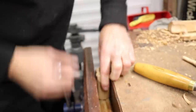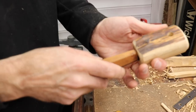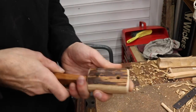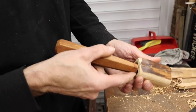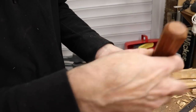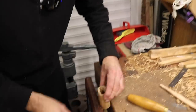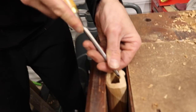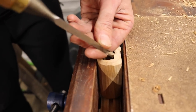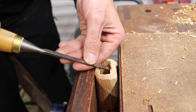Just have a double check. It just helps to locate that tiny little bit more, I think. Yeah, that peg doesn't want to quite go all the way in. So with the position's good, the shapes are pretty good, and come a tiny little bit wider. It's always better off to start small so that we've not taken too much material away, but I can take a bit more off the outsides now, a bit more off the depth there, and then just flick that waste out.